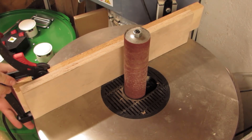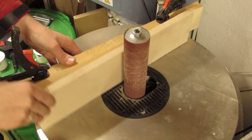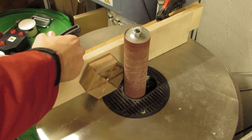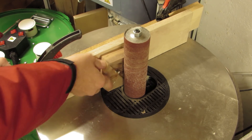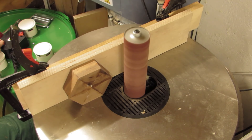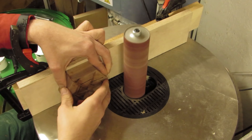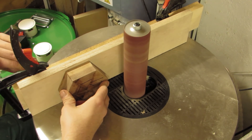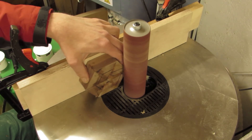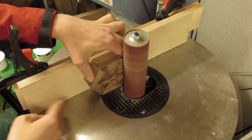This is how it works. You turn the bolt way down and clamp the jig to the table so that your workpiece can pass between fence and drum just about unhindered. Then you turn the bolt — the coupling works better as a handle than the actual wing bolt — to push the fence out just a bit. Pass the piece along the fence, turn the bolt, pass the piece, and repeat until the desired sanding has been achieved, to flatness or thickness.